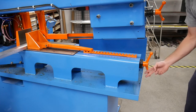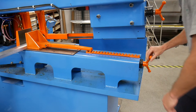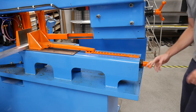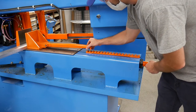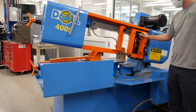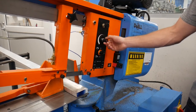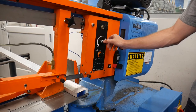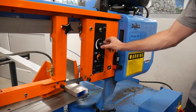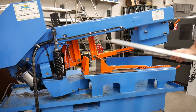The jaws are opened and closed using the handle in the back. Large adjustments can be made by lifting the arm out of the slotted grooves and moving it left or right, or in and out. It is important that you unscrew the clamp back before making a large adjustment so that you have enough travel in the handle to clamp down onto your part. The head of the machine is lifted using a pneumatic button. The head descends by adjusting the hydraulic feed control. Keep in mind, if the hydraulic feed control is open, the head will automatically start descending once you release the lift button. You must close the feed control to prevent the head from descending. Once you have the head raised, you can now put your bar stock in position.